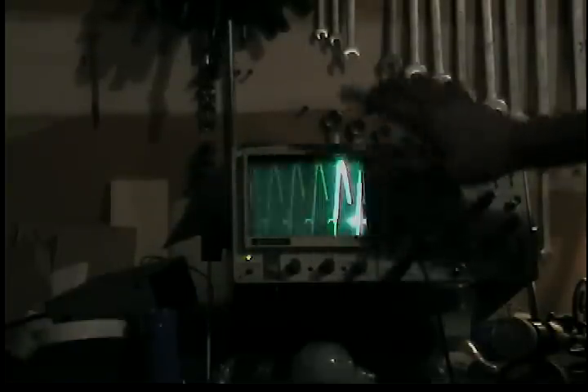I don't know if that's good or bad. Going back to 1x on the scope, it kind of shows us where we're firing. You can see that's our fire, and it interrupts in there. For whatever reason there's no back EMF or that spike — it's either being consumed into the next part or it's completely eliminated.